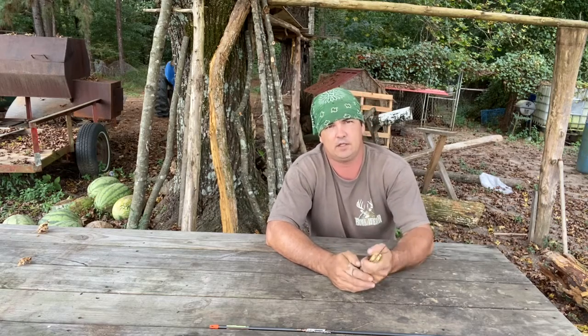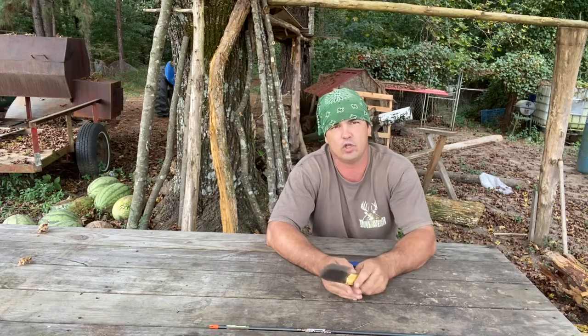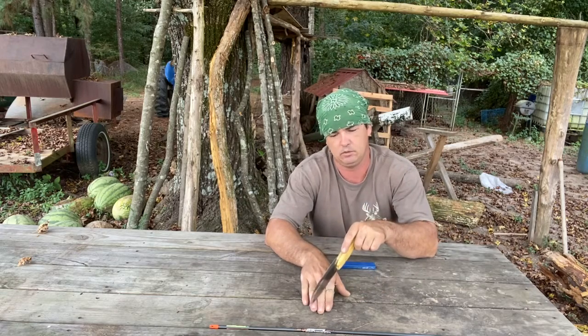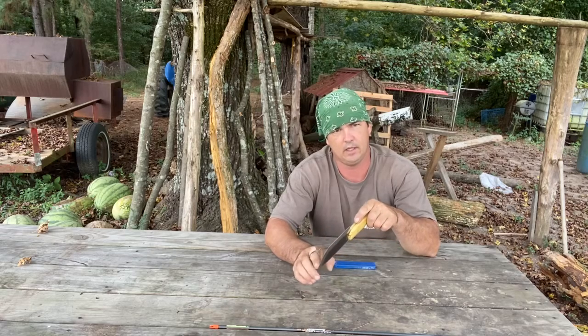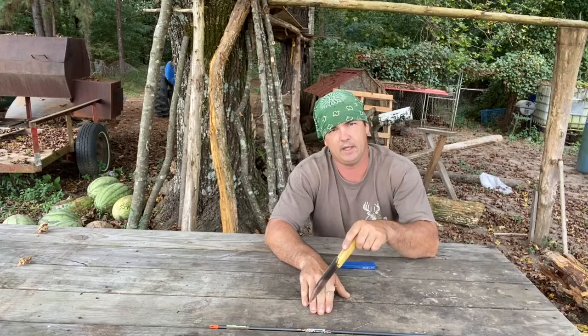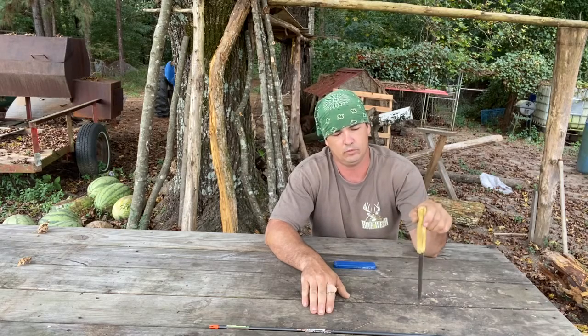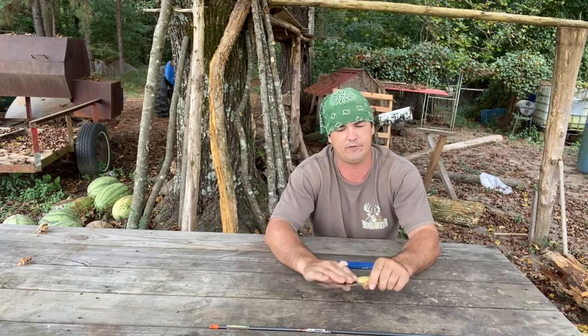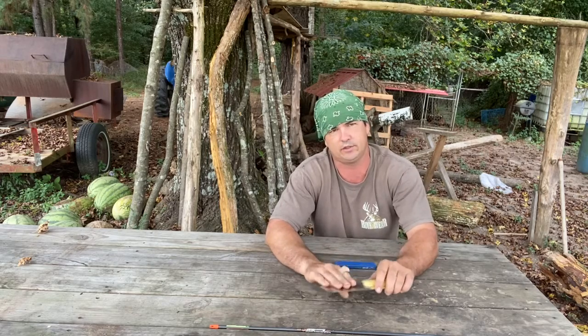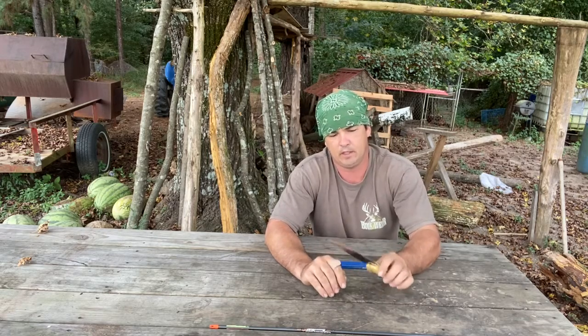few. When I tempered them, I would fire my forge up, put this knife in it, back spine down, so that I don't heat the edge too much and melt it, and heat this blade up and then dip it in burnt motor oil. And it gives it a nice black finish on the blade, and that would be the only reason that I would want to do this to this blade. But I'm not gonna do it.